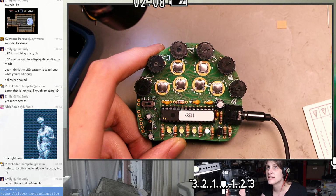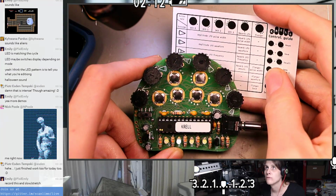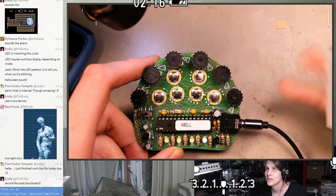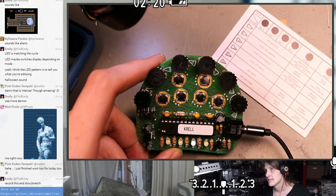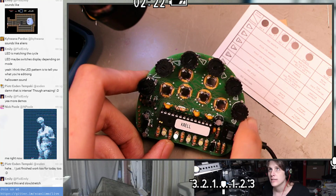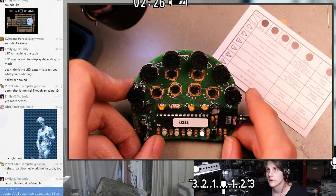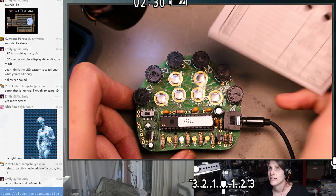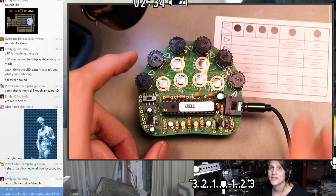Yeah, and then the actual synthesizer it's implementing is this pretty neat 4-voice oscillator contraption with a bunch of modulation options. And even though it's got these pulsing LEDs, as far as I can tell, it's not actually a step sequencer. The LEDs are more for visual UI functionality. And most of what we're hearing now are the interactions between the frequencies on these different oscillators doing interesting stuff together.